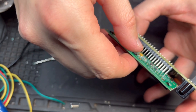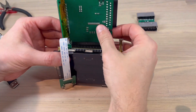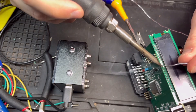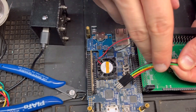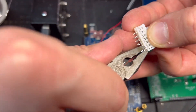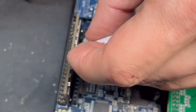For the character LCD display, I wasn't sure if there was meant to be a right-angle adapter, as there was little info. I bent the pins to a right angle, but had to go back and bend them to 45 degrees as the LCD blocked the micro SD slot on the DE10. Then I inserted the pins and soldered. The audio ribbon cable needs to be modified to reach over to the pins in front of the SD RAM — you can splice in wires or use an extension cable. From the ethernet side of the DE10, leave the first four pins vacant and plug into the next four.